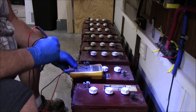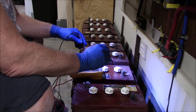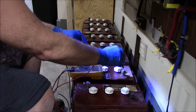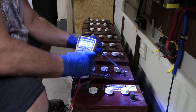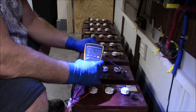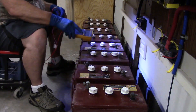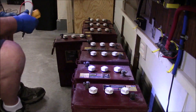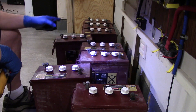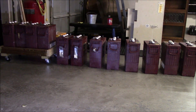This is what I wanted to show you — I checked DC voltage on each of these six-volt batteries. This one is sitting at 4.2 volts. I kept checking all the others and found that each string essentially had one battery that was toast: one down at the end at 4.3 volts and another at 4.2 volts. Just those bad cells were killing my whole system — the battery couldn't even hold a load.